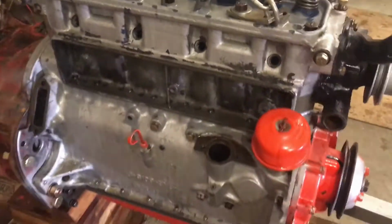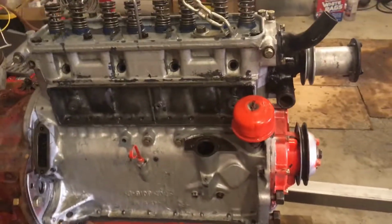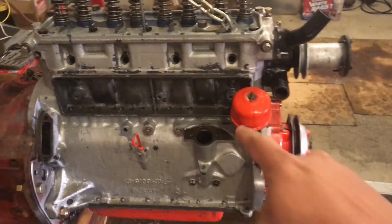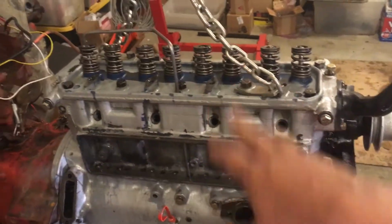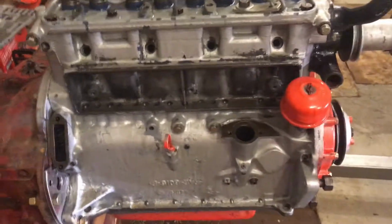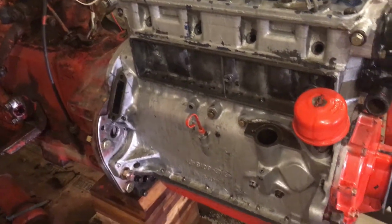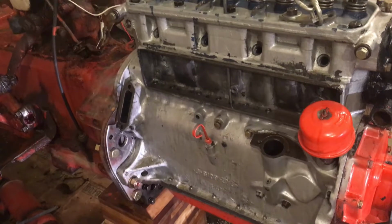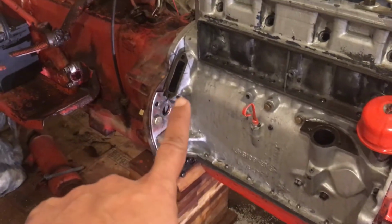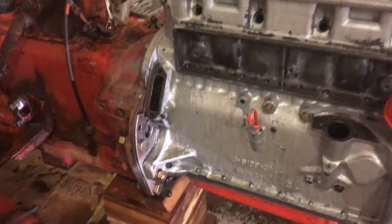It's not difficult. An easier way is to have someone rotate it while you are spinning the oil pump. That's already documented. The passage for the head and rocker assembly is documented in the manual. So that's what it is. Now I think I should be okay. The only thing I'm concerned about right now is that I have to prime the hydraulic pump, because it's completely drained.